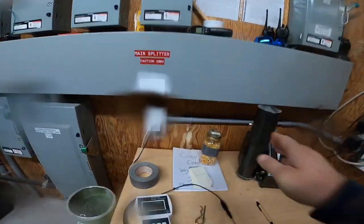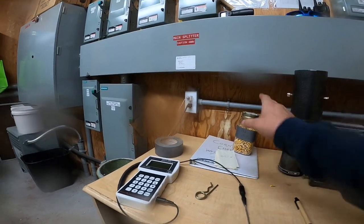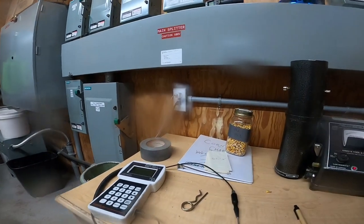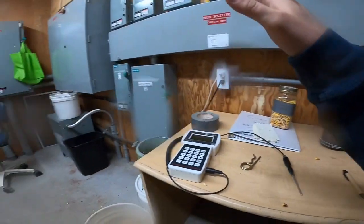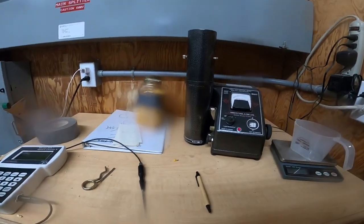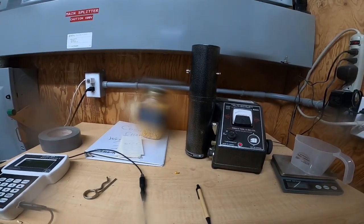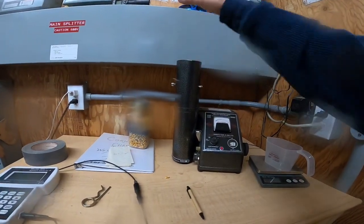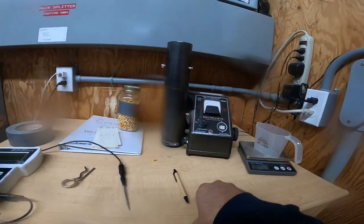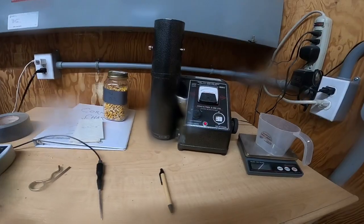Long story short, I got a couple of these samples from the truck. I got more of these, I'll take them all to the grain elevator, get them tested, see where we're at. I'm going to box this baby up and we're gonna go get them calibrated, and talk with my mom and my brother. I'm thinking we're going to get another moisture meter here on the farm, so I can get both of them calibrated, and then throughout the season I can compare both of them, make sure they're within half a point, quarter point, whatever it is, because 1 point is unacceptable.